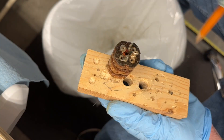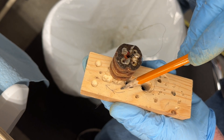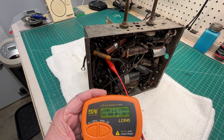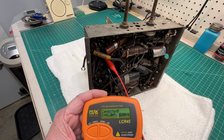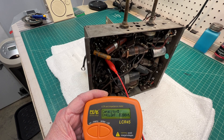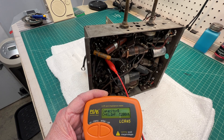As you can see on the piece of wood, I put my winding direction down for future reference. The other thing I want to do is confirm the capacitance of the capacitor that allows you to tune the IF transformer and peak it to 181.5 kilohertz. As found, you can see it's just north of 40 picofarads — that's going to be correct. If you plug that into an LC calculator for a coil that measures 18.9 or 19 millihenries, based on the other coil that's not open being the primary — we'll assume both are the same — that would resonate very close to 181.5 kilohertz.